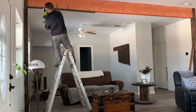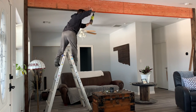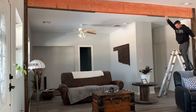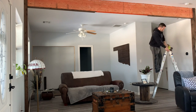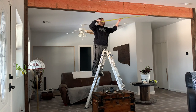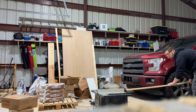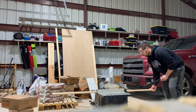I just use a nail gun for this — very simple. These are 18-gauge nails and they've held up just fine. So we hit the edge parts first, and then I'll measure right here to get the precise measurement of what this middle piece needs to be. Then out to the cutting we go.